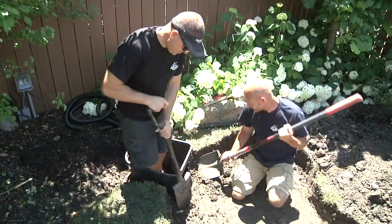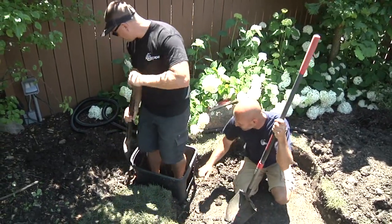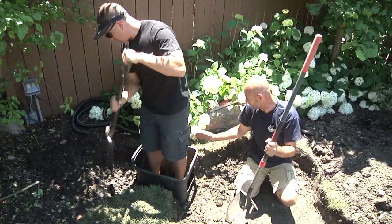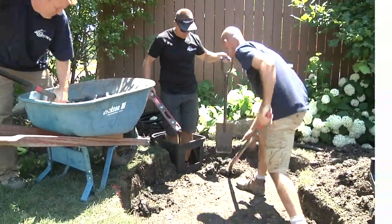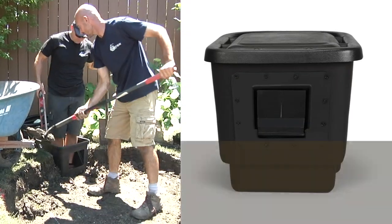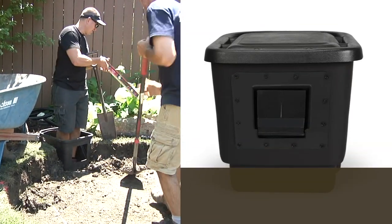Once leveled and set to the proper height based on your water level, backfill around the filter with loose soil while standing inside the unit to prevent it from shifting. Recheck the level after backfilling and be sure that the depth of the shelf in front of the skimmer is several inches lower than the bottom of the faceplate opening.